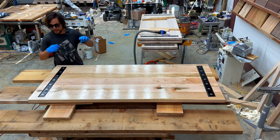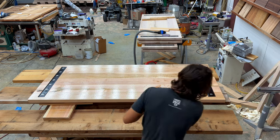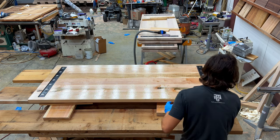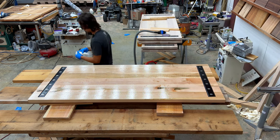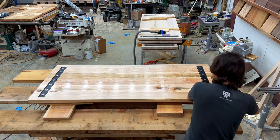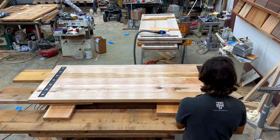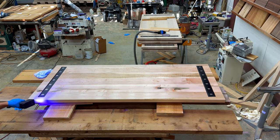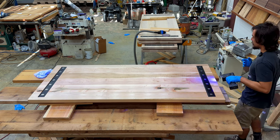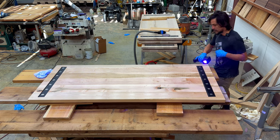It's really important that you wipe all of this off — you don't want any excess on there. The better you wipe this bottom edge, the less touch-up sanding you'll have to do when you flip over. What you see is what you get with Clean Armor — if you see lines before you dry it, that is what's going to happen. The Clean Armor is super hard, flexible, and self-healing, which is tough on abrasives. Now I'm going to cure it. This coat will be noticeably smoother than the first coat because you deburred the first coat, but it will still have some burrs — each one of these is essentially popping the grain again as it cures. I'll be repeating all of this on the top side as well.